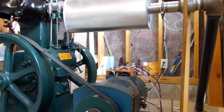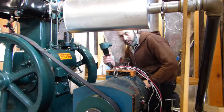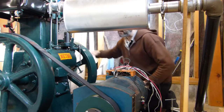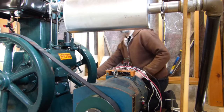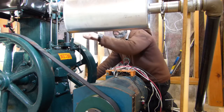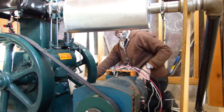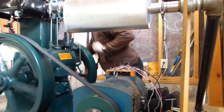All right. So let's try to give this sucker a shot. First of all, I hope you can see this. You put the crank on, and you roll it backwards a few tries just to make sure the ratchet mechanism and everything's all good, because you don't want to take your arm off, of course. So I'm satisfied with that. So we start cranking, and once we get up to a decent speed, we flip the fuel rack down, listen for the clinking, and once we hear it, we swing the decompress lever to regular compression. So let's get it rolling.